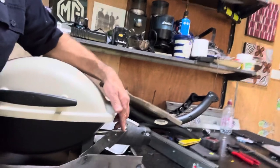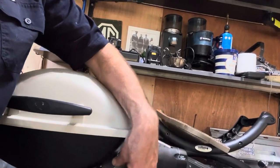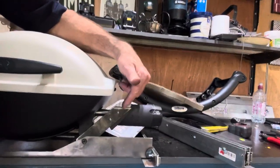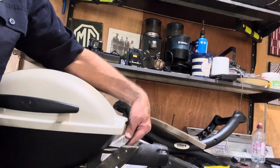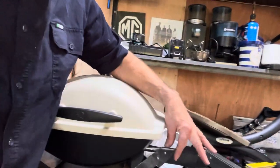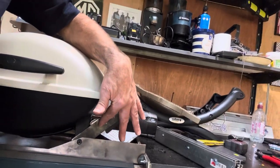With a bit of liquid chalk, I marked it to get the angle right, and basically took it apart and put it back together repeatedly until I got it right. I drilled two holes in the metal where I thought it would be about right, then drilled right through the plastic. At the back there are two original holes and two new holes — you never see them because you're not looking from behind. The only thing I noticed is it needed to be offset a little bit, so I heated it up with an oxy torch and put a kink in that piece of metal.